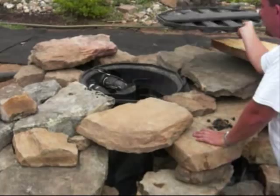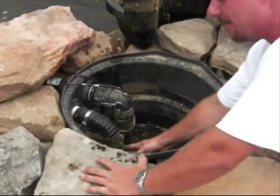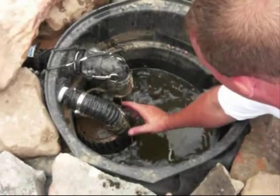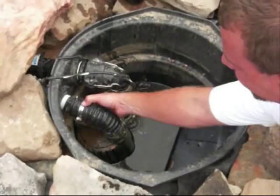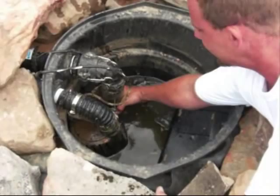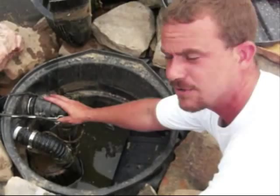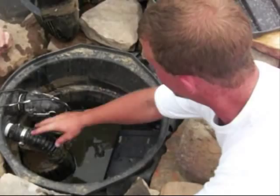We can show you real quick — the pump's inside this thing. From when we had it up and running, our skimmer basket's working. We've got a pump here and a pump buried down in here. That's one reason we drained it out after we got it running — the water started getting pretty bad. Both of these pumps are quick connect. All we've got to do to pull the pump out is pull these rings. On this one, we use two different kinds of hose to show you the difference. This one we just undo a clamp — this is flexible hose. This is PVC, but it's flexible; it'll bend and make slight bends. When it comes to going straight down and making sharp 90s, you have to use fittings. The flexible hose doesn't need any fittings. The PVC is a glue type connection; the flexible hose is a clamp type connection.